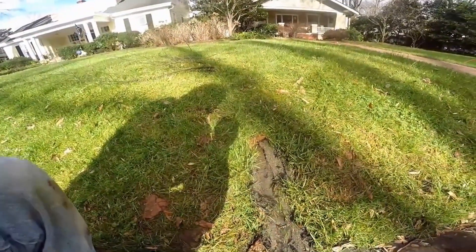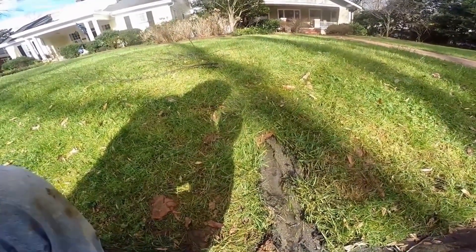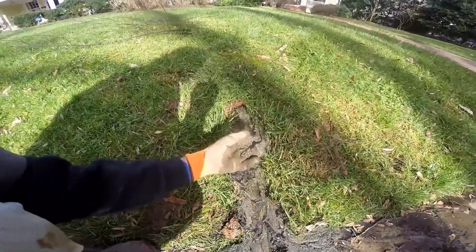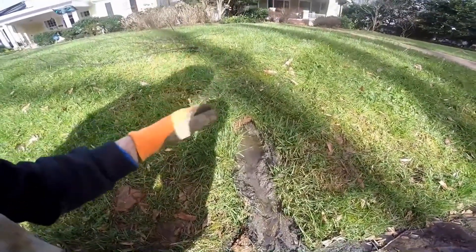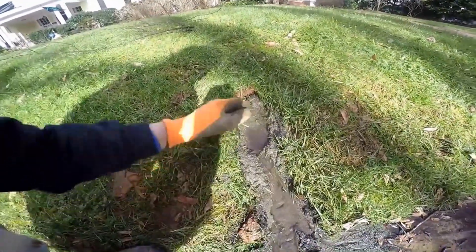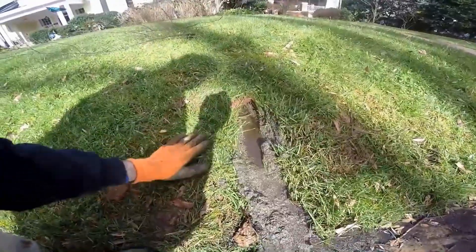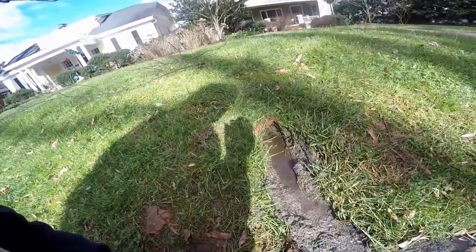Typically in a downspout drain that has a belly in it — in other words, the line kind of runs up and downhill — you'll see this material right here. If you don't recognize this, this is asphalt material, roofing material, and it drops into your gutter. Of course it builds up. This is almost like grease — really difficult for water to get through that. So we've cleaned the line and you can see it's still pushing that stuff out of there. Water is the best thing to move that, but sometimes the cable really helps clean.